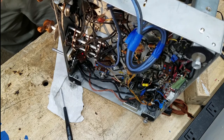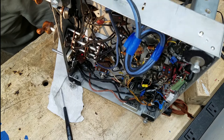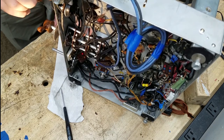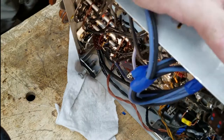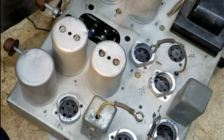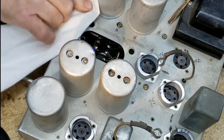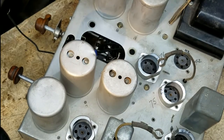If you just push the shaft down opposite the side you're spraying into, you can get some DeoxIT in. I do apologize for the poor camera work - I did the best I could. It's quite a bit looser now and I don't think it's coming from lubricating the shaft itself - it's actually getting inside. What a mess that stuff makes. Now I want to clean this area up - a little bit of lacquer thinner will take care of that in no time. It'll be awfully hard to get to later so now is the time.